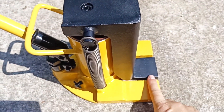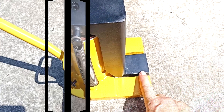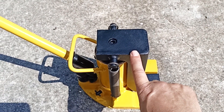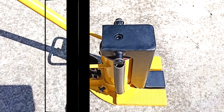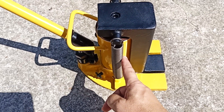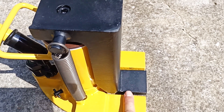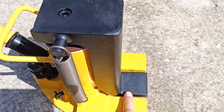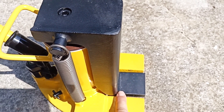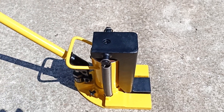With the paw you can lift a load from 16 mm to 13.5 cm. With the upper platform you can lift a load from 22 cm to 34 cm. There are return springs that allow the jack rod to return even if it is not loaded. When using the paw, ensure that the load covers the lifting platform as much as possible, or is as close as possible to the jack rod — this reduces the load on the rod and increases stability.